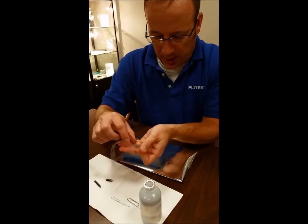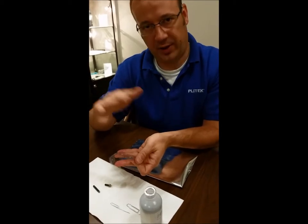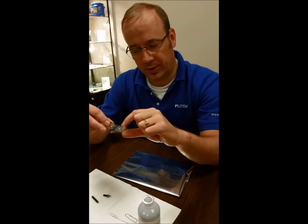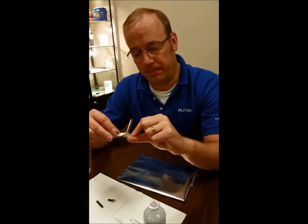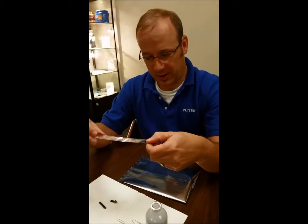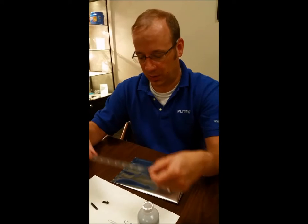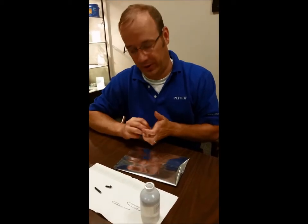There are membranes in the valve which actually separate when under pressure and then reseal. It's important that we get the right amount of oil into those membranes — not too much oil. When you're oiling the valve, you also don't want to let the valve sit on the liner for too long before applying it to the bag. When you do that, you can jeopardize oil getting between the liner and the adhesive and contaminating the adhesive. My recommendation is to oil up three to five valves at a time and apply them within about a minute — two minutes max. Don't oil up an entire strip and let them sit for 30 or 40 minutes, as there's a chance you can get a failure that way.